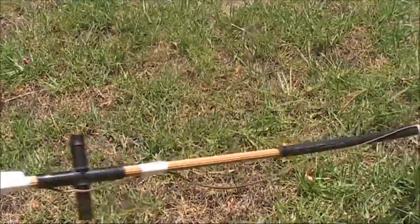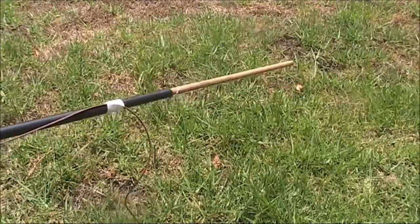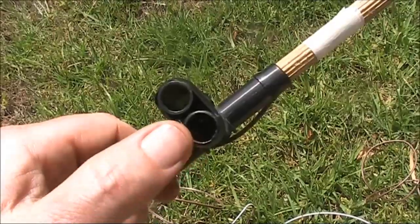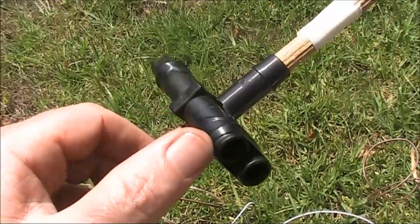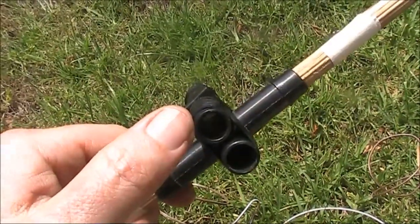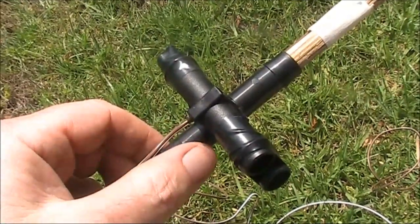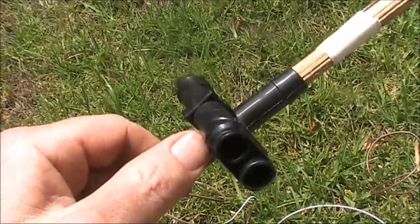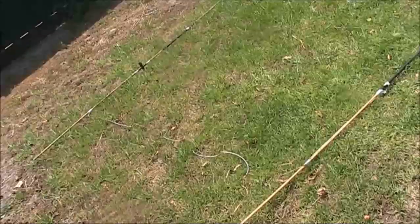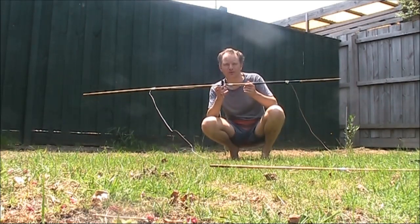This is the top, just over a metre. The overhang is for when I try 28 megahertz later on. Because the rod goes right through this cross piece, I've attached another piece here for the pole to go through. If I was doing this permanently, I'd have a second cross piece and use cable ties. Instead, I'm just using insulating tape, hoping it will hold.